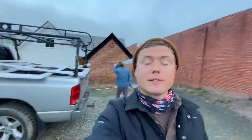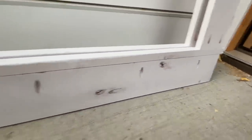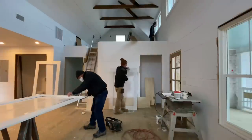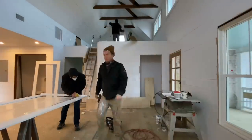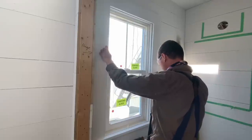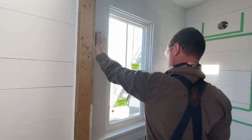We're bringing in some of these window trims that we made back at the shop, and we stand a good chance of getting them installed since that's actually all we have to do today. I want to give you a good look at the back of these window frames - they are simply put together with a couple of pocket screws. Everything is nice and tight, making for a very strong unit and very easy to build. I've planned for about a quarter-inch reveal on the sides and top, and flush on the bottom where this sill extension comes out from the bottom of the other sill. I'm just eyeballing it and feeling with my hand to align it and start shooting.